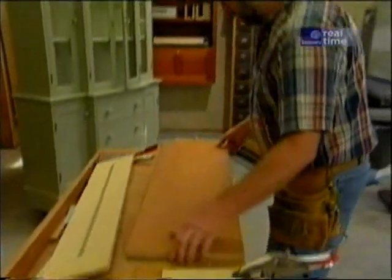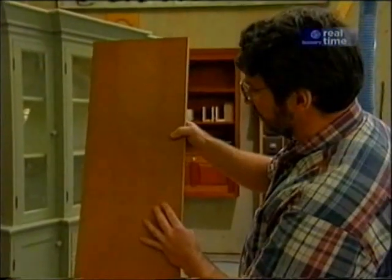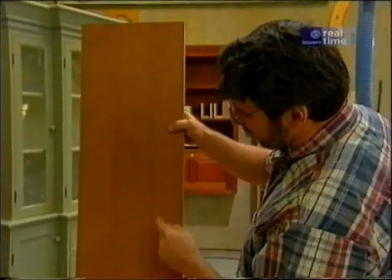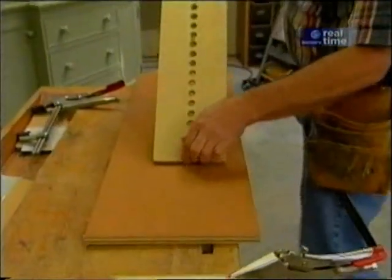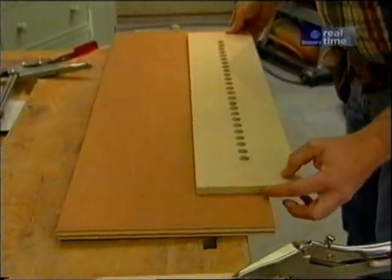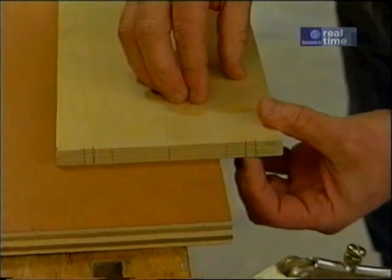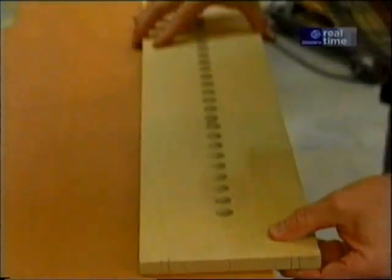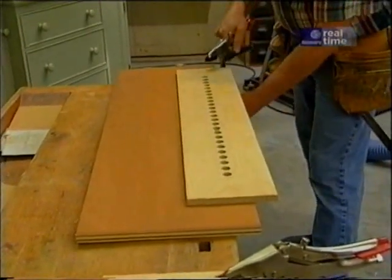If I take this piece of mahogany plywood left over from our kitchen secretary, which also has adjustable shelves, and I wanted to make this into a wall cabinet with a series of holes, the first thing I do is divide the height in half and put a line right at the center. That becomes the key for the jig, which also has a center line. Almost all these jigs have a center line. For the distance in from the edge, on this jig I simply used pencil marks — this is an inch and a half, this is two, this is two and a quarter. So I got to line up this end, the middle, and the other end, and then clamp it in place. And that can be a little time consuming.